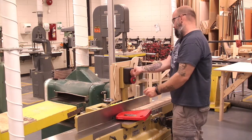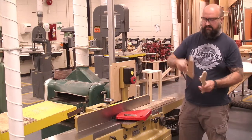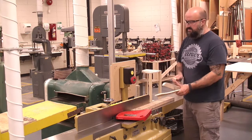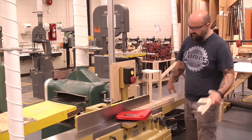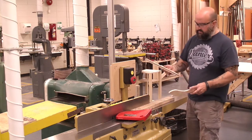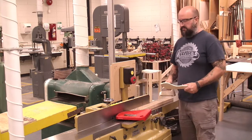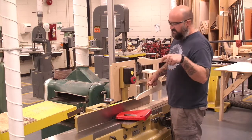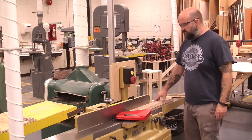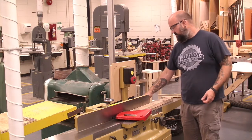I'm going to put the safety key back in and twist it. We're always going to use push sticks on this machine — these become your surrogate hands. I have a right-handed one I really like and a left-handed one. We use the left-handed one to hold the material down and in towards the fence. We always want to be firmly on the table and firmly pressed against the fence. We never want our hands to travel directly over the blade. Even if the blade was exposed and a push stick slipped, I'd hit the push stick, not my hand. The only time you can use this without push sticks is if the material is taller than the fence, but honestly I still use a push stick even then.